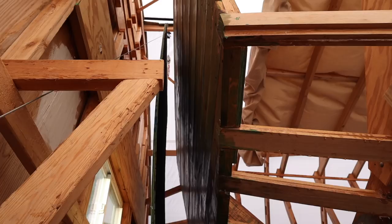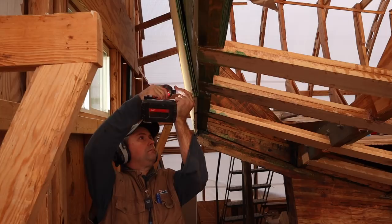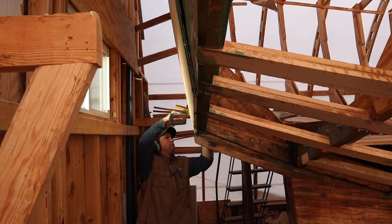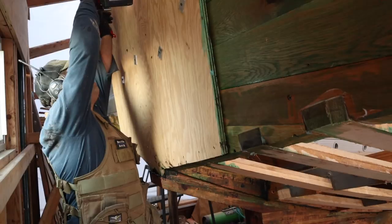The installation of the first layer of plywood going over the solid wood planking is a pretty shippy process. We use copper naphthenate as a wood preservative and tar to help keep water out of the joints. With the second layer of plywood, that will be epoxied onto the first to create that monolithic skin I spoke of earlier. I didn't really worry too much about the alignment of the planks. We just ran those through the planer. We didn't really surface them to be flat. I knew once I added the plywood and the screws and the bolts that it would pull everything flush.